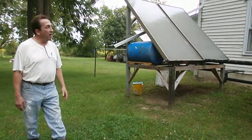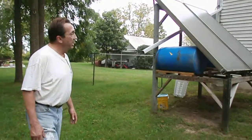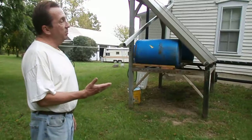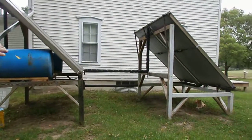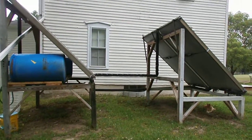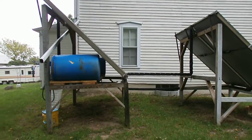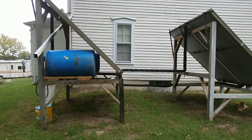We're going to walk around to the back. We looked at our 4 domestic water heating panels. This hybrid system was built on a ground-mounted rack because I didn't want to put this equipment on the roof. Everything is southern exposed, so we have optimum sunlight, with no trees or limited trees to cause shading. On the back side, because the rack and gutters were already here, I opted to collect some rainwater for watering vegetation.